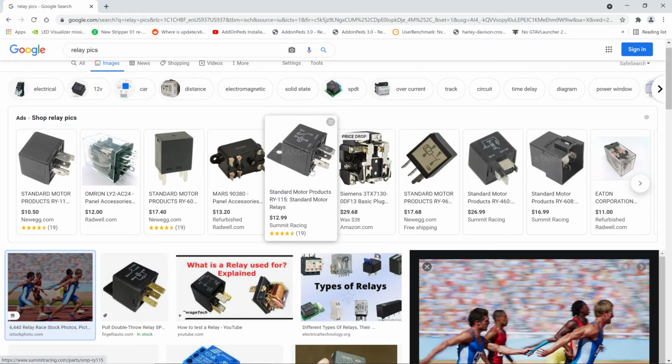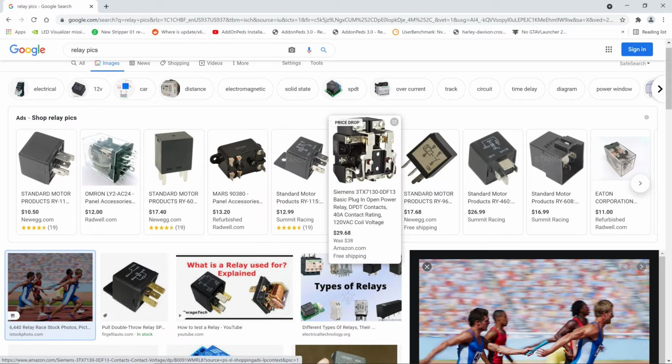Relays. Now, see, they have terminals on them. The most basic relay of all is going to have pretty much 4 terminals, the most basic ones. And then, depending on the type of switch that you had, remember we were looking at switches in number 1. Remember the switch that you could throw to the left and throw to the right because it had a center pole in it. Well, that switch is the same thing as a relay. A relay is exactly that switch, except it is controlled by a voltage rather than your fingers. Okay? It's that simple.